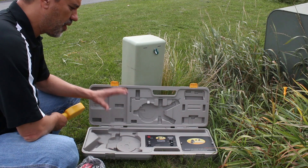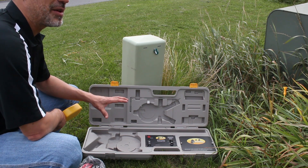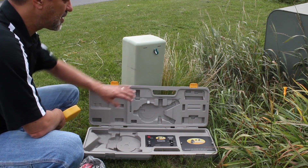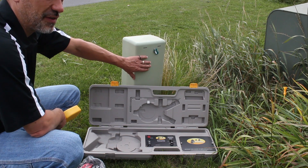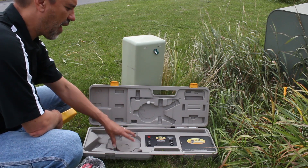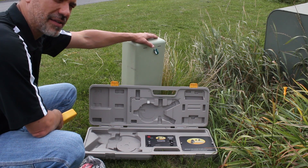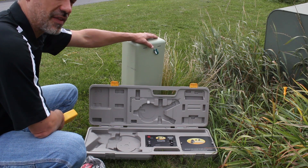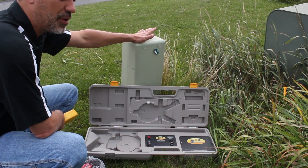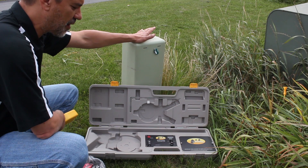With a broadcast antenna, you could consider this a little bit like a shotgun — it's not connecting to just one cable, it's connecting to all cables. I've set it up here against the cable TV line that runs into this home, and right now that antenna is putting a signal on that cable TV cable without me having to get into the box, without me having to unhook anything, so grandma can keep on the internet while we're doing this. That's the beauty of inductive locating — you don't have to take things apart, you don't have to use alligator clips.